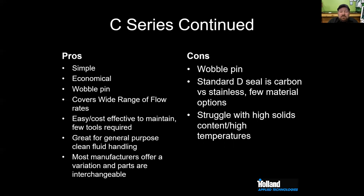You can use some, but at the end of the day, you still have to unbolt it from the skid, right? And mess with all your process piping, which hopefully is properly aligned, but oftentimes something's off and you're fighting it. But it's definitely better, at least I've found, to change these seals out when nobody's watching and when you're not under a time frame.